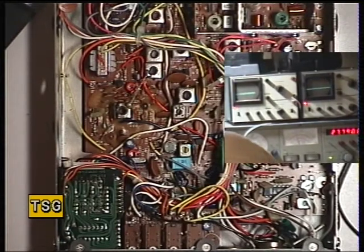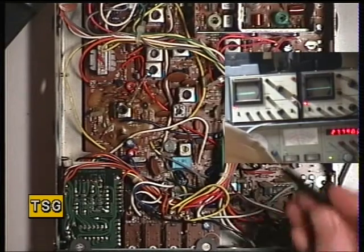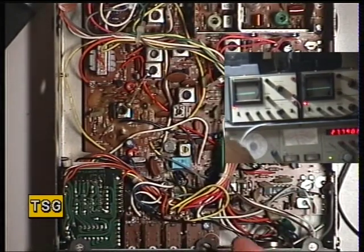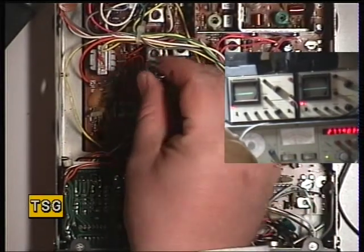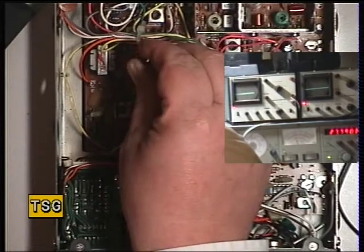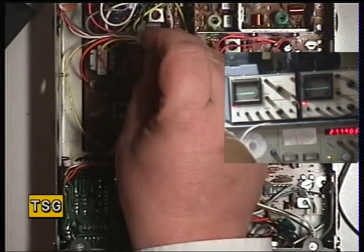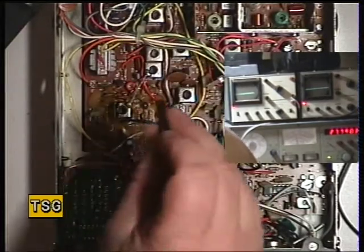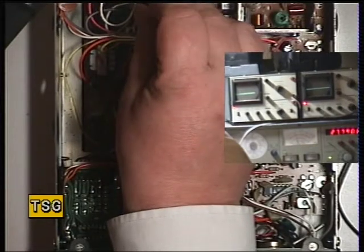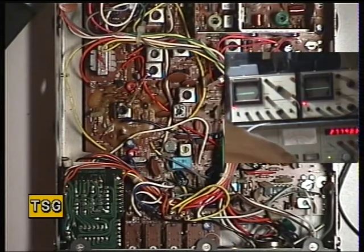You can see the meter's now gone over. The first coil to adjust, using the correct trimming tool, is L4 — T2, T3, and T4 in that order. Transformer 2 is that one. So we're just going to peak that for maximum — and that is maximum. T3, which is the next one along, peak that for maximum. And then T4, which is just there, we'll also peak that for maximum. They didn't actually move at all, so there's no improvement being gained. It's actually giving out 1.8 watts at the moment.